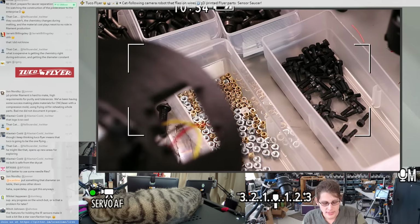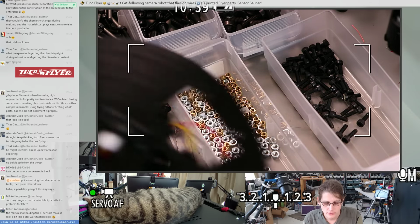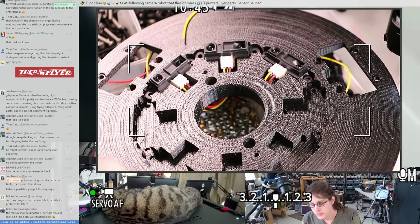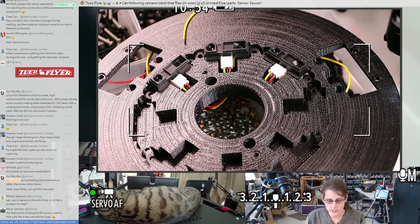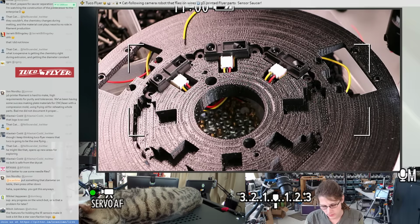Because one design I imagine is to have maybe 8mm threaded shaft down the middle of the winch, bearings on either side, and then printing a gear into the perimeter of the spool, and then having another gear on the output of the gearbox I have. I think it might be useful to have a little bit more reduction, and that helps with the coupling problem.